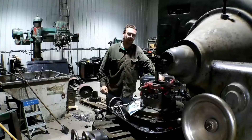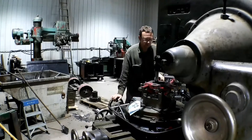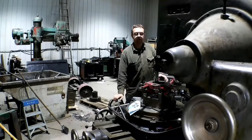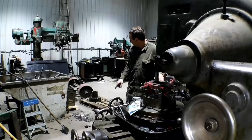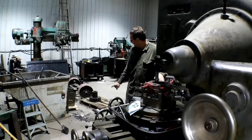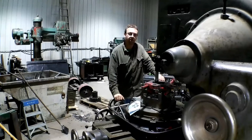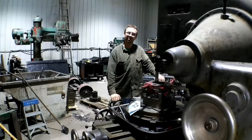We got that all done. The keyways are opened up. They're a couple thousandths oversized, cleaned up at the bottom, looking really nice. Now we're going to get the bull gear. I'm not sure yet if I'm going to do that on the Bridgeport or set it up on here and do it externally with the slotter, because it might work better this way. I'm going to think about that a bit and then the next scene you'll see where we go.